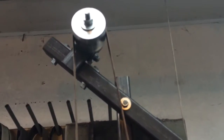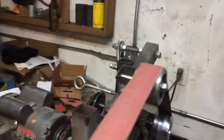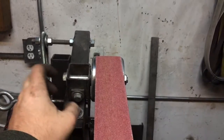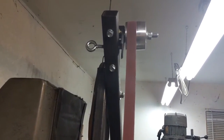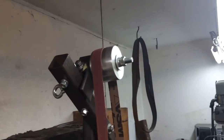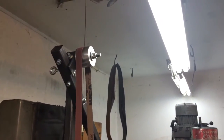The tracking arm is pretty basic — I borrowed the design from the no-weld grinder sander. It's basically just another short piece of square tube that the wheel mounts onto and pivots on some brackets, notched out to go back and forth with a tracking knob. I used a 3/8 inch eye bolt for that — cheap and it works. The idler wheel I got off eBay for about $35-$40; a little cheaper than a Beaumont wheel and maybe not quite as nice, but it should get the job done.